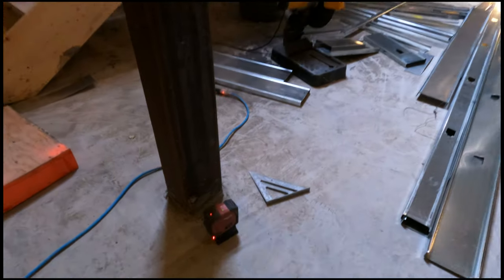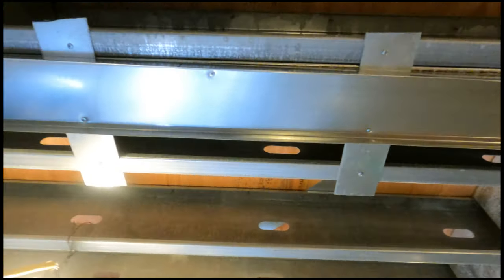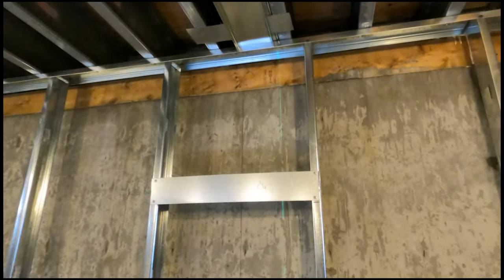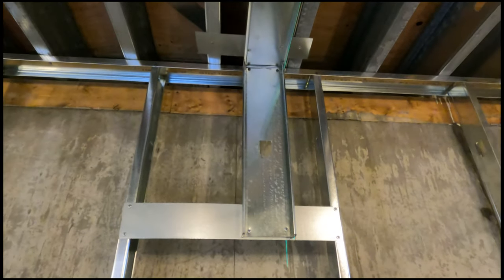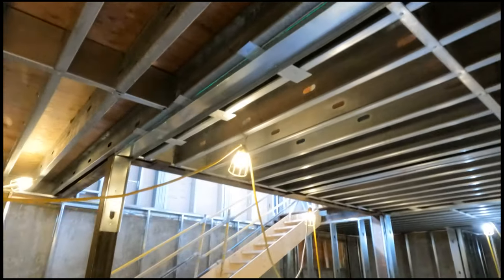In this situation I'm using a combination of pin lasers and a line laser. Get your top track on perfect, and then you have your layout on the ground — you can use a line laser as well. The line laser is nice for when you're doing your bottom track to check that it's in line as you go, because when you're screwing in and squaring your studs it can get twisted, so you want to keep it straight the whole time. I kept the studs up a quarter inch from the clip so I have room to put the bottom track on. I think it's a six-inch bulkhead — two screws in the top track and one on each side in the clip, and again clips every two feet.